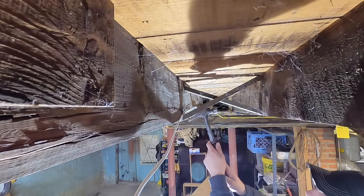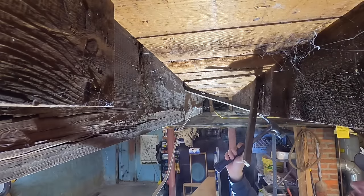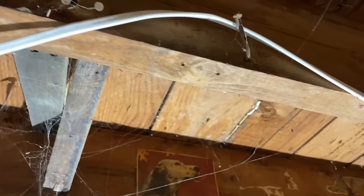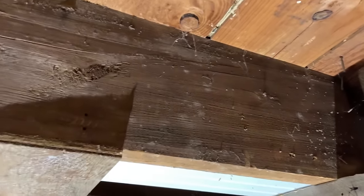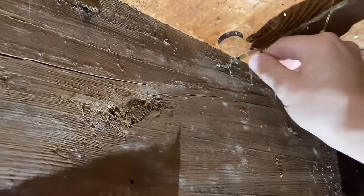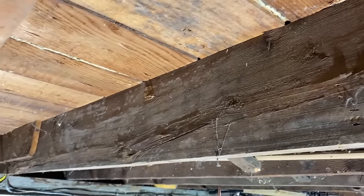I don't think I have to cut these — I don't think they're in there very good. My wire is tucked out of the way, and now I just want to check to make sure there's no nails or anything sticking out like this. I think that's more than an inch and a half so I might be okay, because I'm planning on putting the top in first and then sliding the bottom over. If it gets in my way, I'll have to cut that. There's a knot — I'm going to have to hammer that up or it'll just get pushed up with the joist. Just go along the bottom and make sure there's no nails sticking out — that's going to stop my board from going in there.